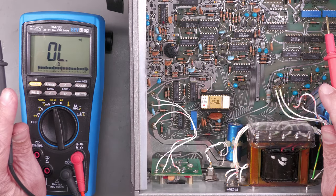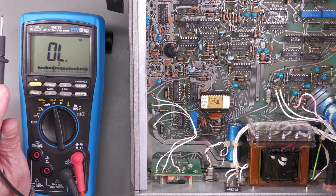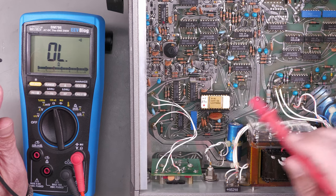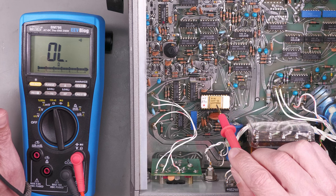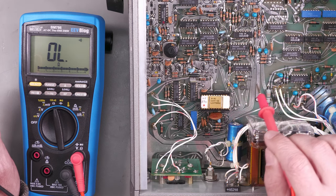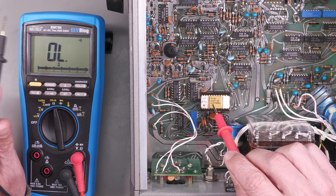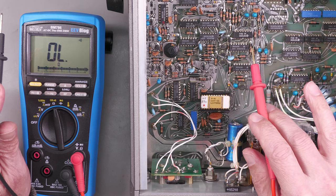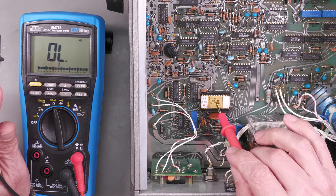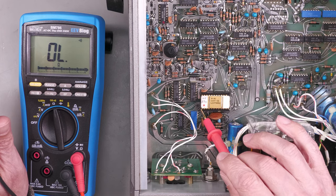This is how I opened it up. But one other curious thing that the seller noted in the eBay ad, they were able to confirm that this chip was actually faulty with the broken pin, obviously, because they switched out a good 224601 in its place, and the unit apparently powered up perfectly. And I'm assuming they put the chip in as they found it, i.e. we'll assume that pin 1 is indeed at this bottom corner.